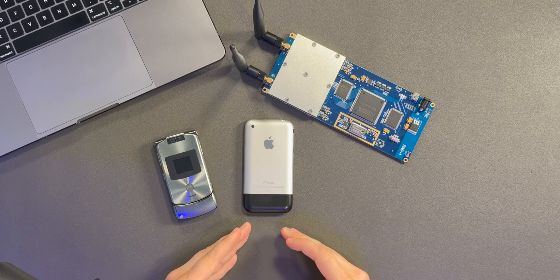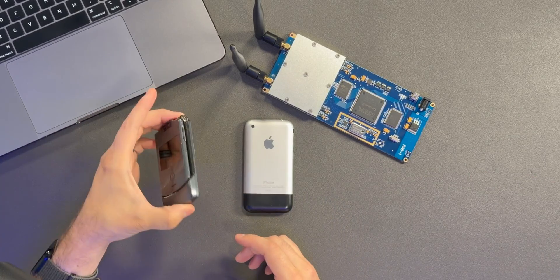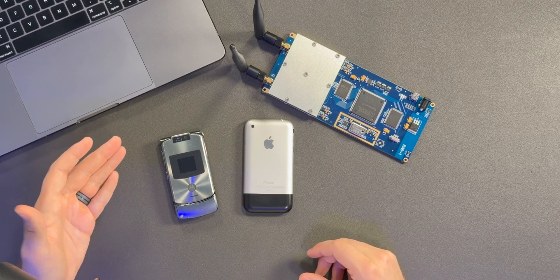We're also going to talk about the software side that drives all of this, which takes place on macOS and Ubuntu Linux — those are the host machines that make it all happen. As for supported phones, that has been a big question: any phone that supports 2G, more specifically GPRS, is compatible. That includes the first-generation iPhone all the way up to the iPhone 12, and it also goes back to older flip phones, Blackberries, and Android phones. Any phone capable of joining 2G can use the base station.